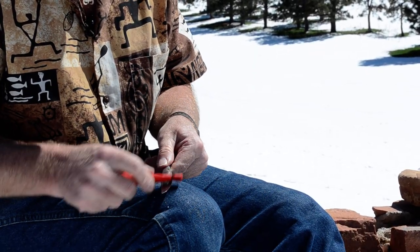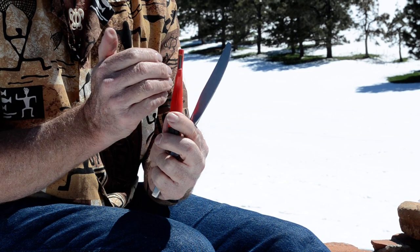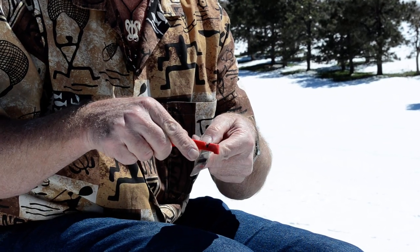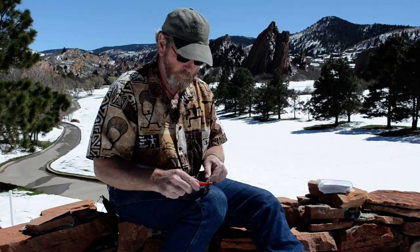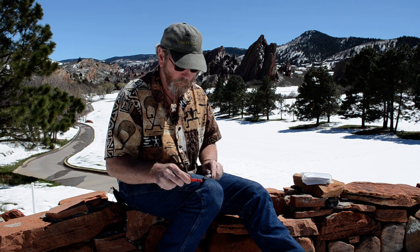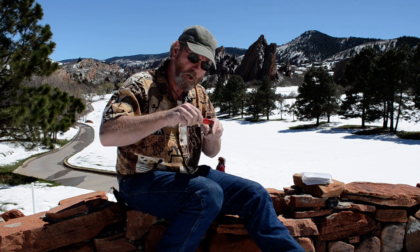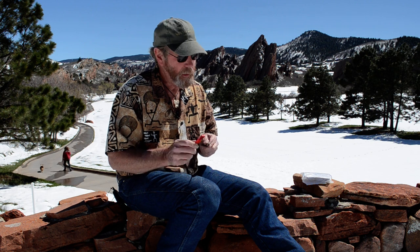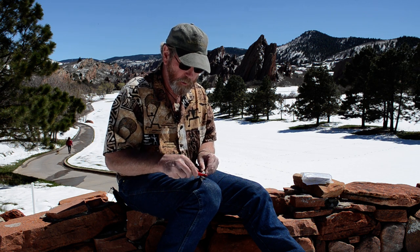So let's fine-tune it a little bit with the open face and see if we can see a visible, noticeable difference. What I'm doing here: I have two edges right there — 90-degree corners. You have a flat surface, flat surface, flat surface — that gives you two 90-degree corners. I'm going to set it on there, match the bevel I've created, then turn it approximately 45 degrees, put the knife on my leg like this, and slide it from the handle out to the tip. I'll move towards the tip around the radius. I know the knife is getting pretty sharp because when I flip it over there's a little wire edge — like little feathers sticking up — so when I run the sharpener down it and it drags back, I know I'm cutting the wire edge off the blade.